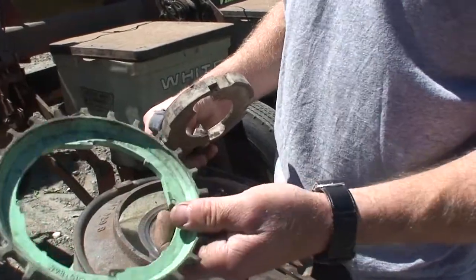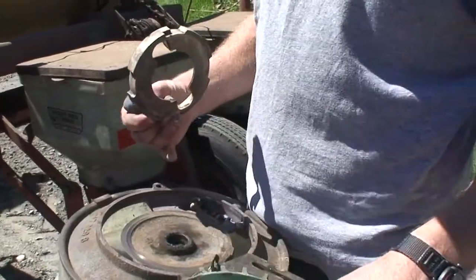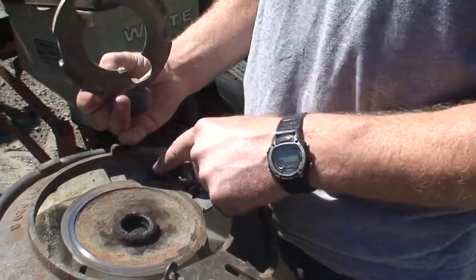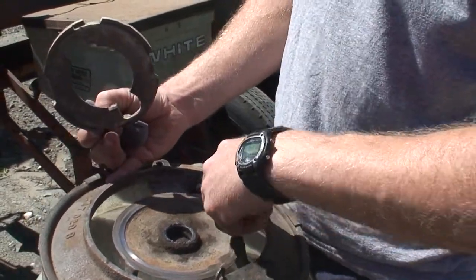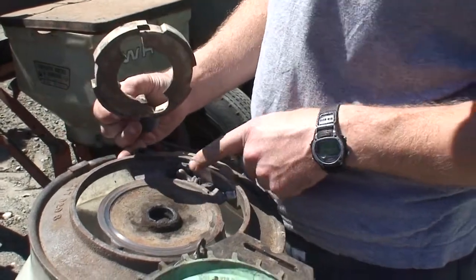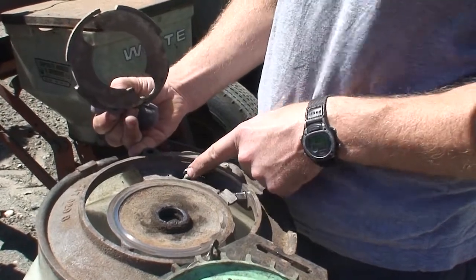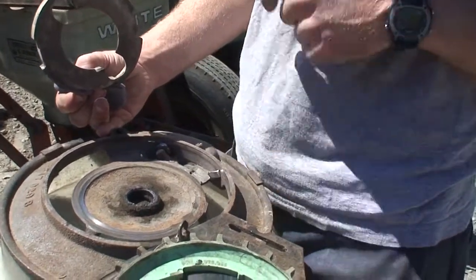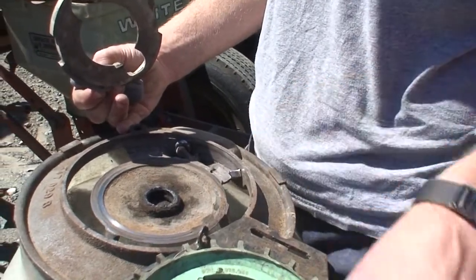You can change this portion here. Lincoln Ag Products makes them in plastic — they're much cheaper than the old metal ones. An important part when taking this apart is what I call the roller or knocker right there, that goes between each cell and helps knock the seed out. If you're changing variety trials, you want to make sure you clean this extra seed out, or you'll get some of that in your next variety. This also helps prevent too much seed from going in at the same time.